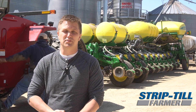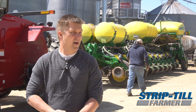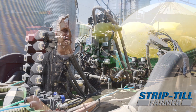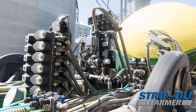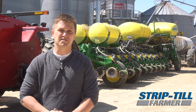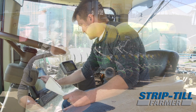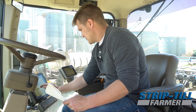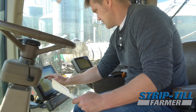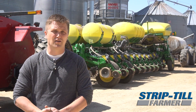For example, this planter has to be controlled with the John Deere GS3, and in order to properly do that we're actually running some harnessing from AG Express that bypasses the Case IH ISO line. So right now the planter itself is being run completely by John Deere, totally separate from the Case IH ISO bus system. As far as integration with multiple colors, we work mainly with AG Leader mainly because it integrates with all brands, makes, and models of equipment.